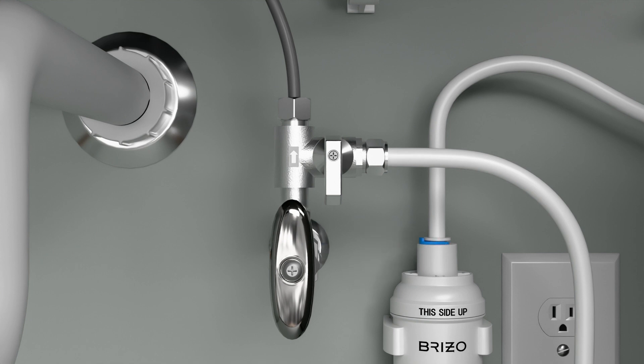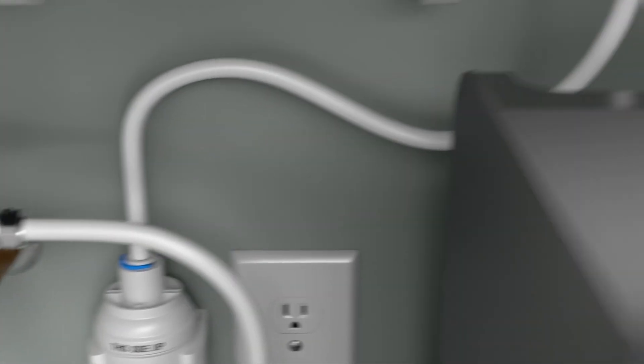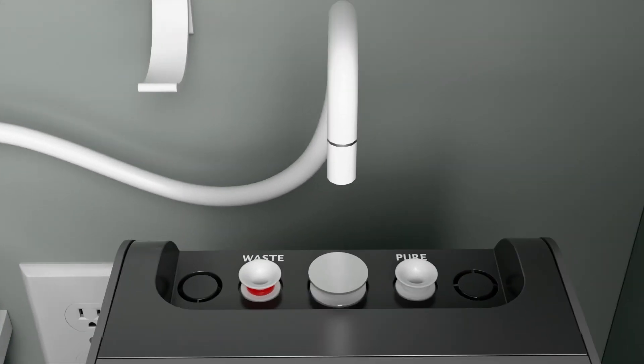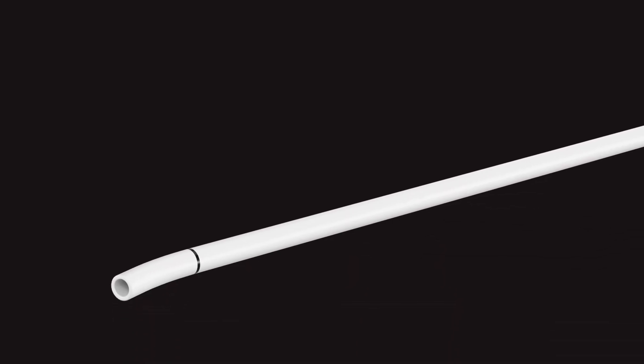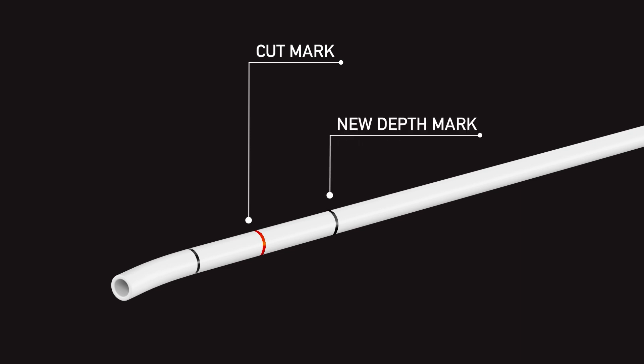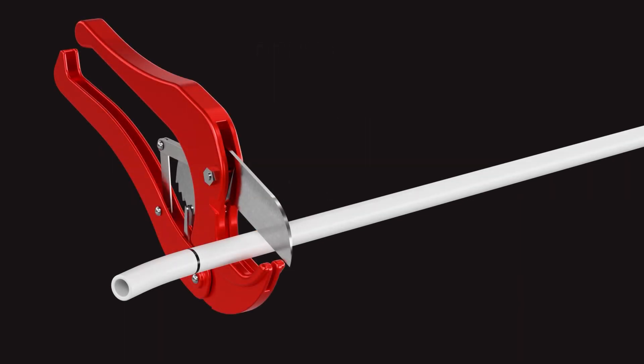Next, take the end of the hose from the outlet of the pre-filter and connect it to the back of the RO system at the port labeled IN. Remove the existing plug by holding the outer compression ring down and pulling out the plug. Line up the hose from the pre-filter with the back of the system and push it straight down into the push connector until the reference line fully disappears. Secure this connection with another locking plate. At this point, you can wait to place the pre-filter into the C-clips until you put your RO unit in its final place. If any of the tubing must be cut shorter and cuts off the existing depth mark, make a new mark 5/8 inch from the end of the tube as a reference line to ensure the hoses are seated at a proper depth. If cutting is necessary, use a PEX cutter to ensure the cuts are straight and smooth.